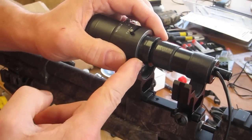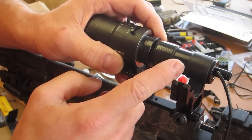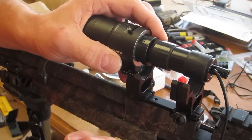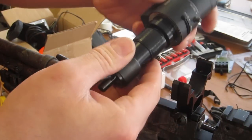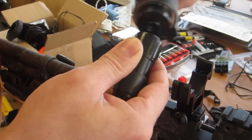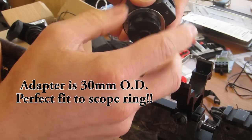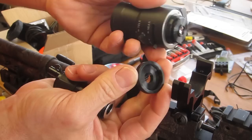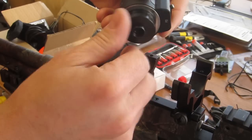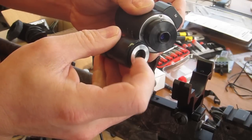The cool thing is what we had to do here, or how simple this was to mount. So we're using a larger CS lens on the front of the bullet camera, which usually takes a lens that's designed for the board camera, which is an S-type lens. So this CS lens has an adapter from Edmund Optics. That link is going to be updated in my Excel spreadsheet. And right here you go. It's a simple female thread for the CS. That lens then is adapted to have the same threads as a normal board lens.